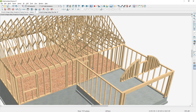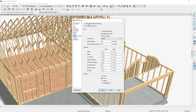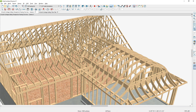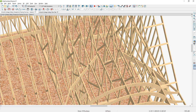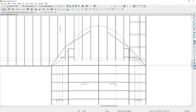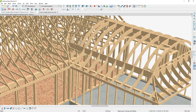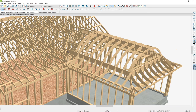For this section of the roof we're just going to stick frame it — there will need to be some cleanup as it's a fairly complicated roof. Go under the build menu, into framing, and choose roof framing to stick frame it. It does a pretty good job on this roof. Zoom in, delete some components that aren't needed, then go back into the 2D view. Grab a couple of framing members where there's a gap just above the trusses, select the copy tool, and slide a copy up until they snap into place.